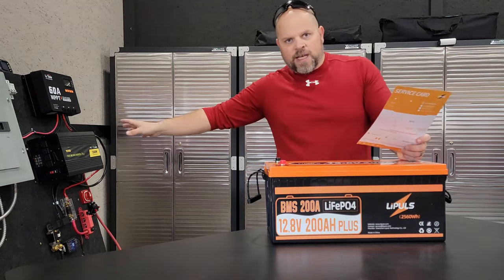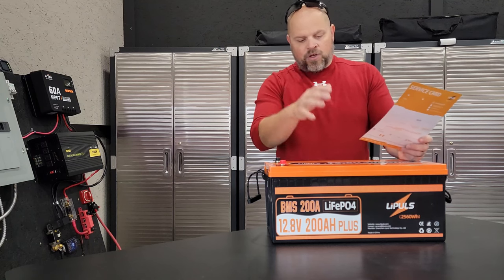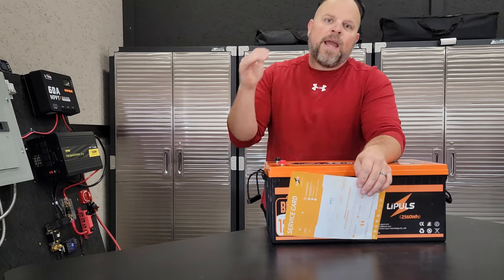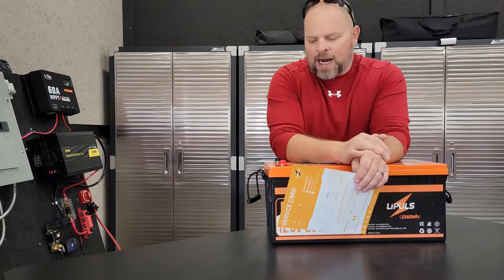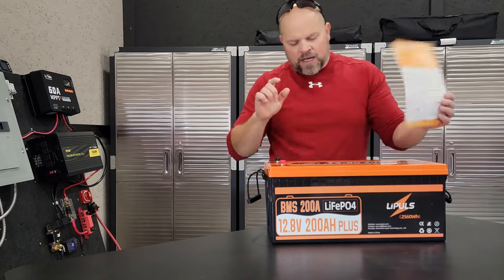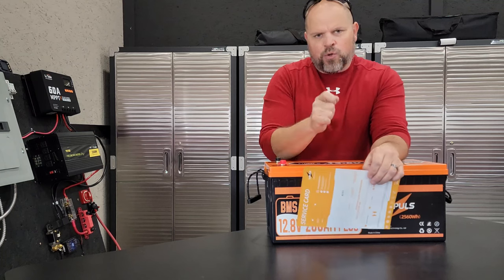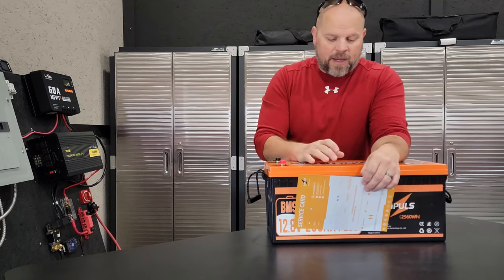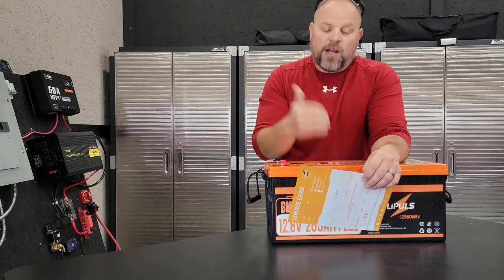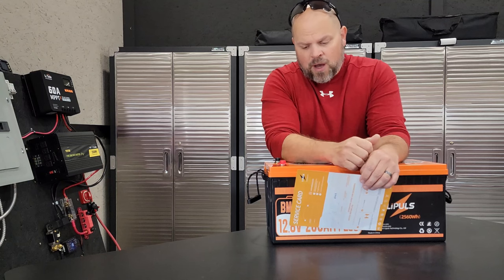I'm going to hook it to my little test station here on the side, and we're going to hook some appliances to it, and we're going to see if we can shut it down. This video is not one of those videos where I cut it open and go over everything on the inside. I might do that in a future video, but I think it's important to find out, does it actually work under a load? I want to see if that BMS says it'll shut off in 5 seconds at say 300 amps, then it should shut off at 5 seconds with 300 amps under a load.